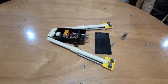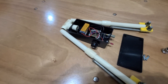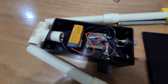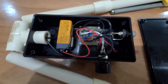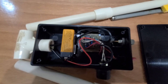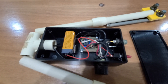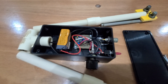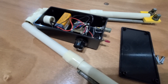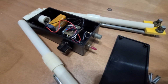One last beauty shot here with the case actually open — this is a big part of the assembly. When we receive our kit to put together, we'll show you how all of this goes together. Notice it is powered by a nine-volt battery, and it has one PCB on the inside. A little bit of soldering needs to be done on the connector for the BNC connector, the power connector, and the leads going out to the telescoping antenna elements. So it's a relatively easy build, and all of this is included in the kit.